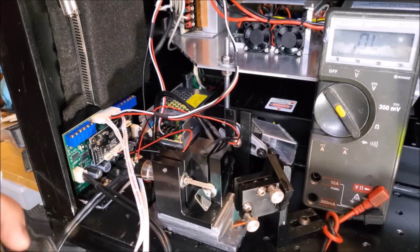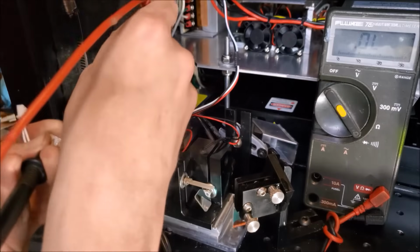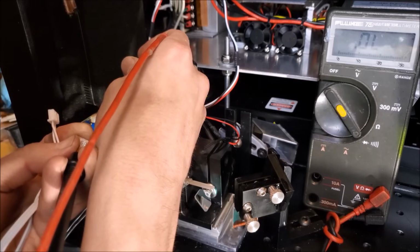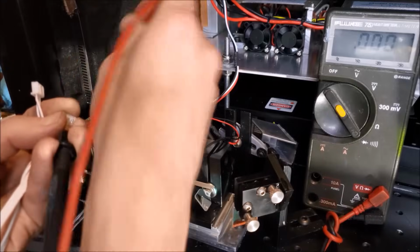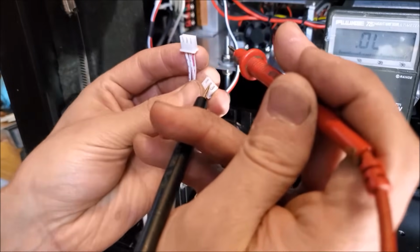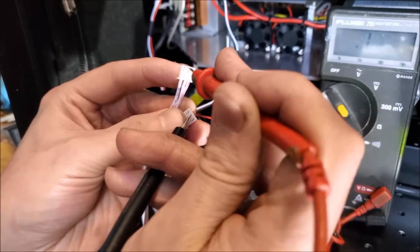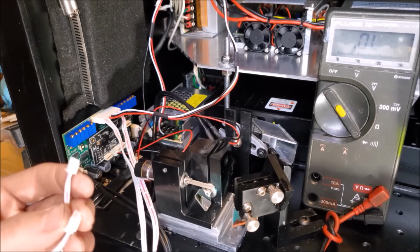Makes it beep. So, as I said, I figure it's the sensor wire. So, will we get a beep if we touch that to ground? We sure do. Okay. Let's test the other side. Actually, you know what? Now that we know that one's ground, if we test the two sensors, it beeps. So those are our grounds for signal. Okay. Let's see if it tells us which is positive and which is negative. No. It's going to make us guess. That's nice.